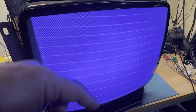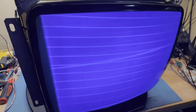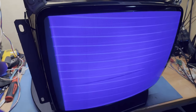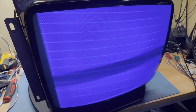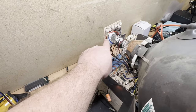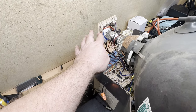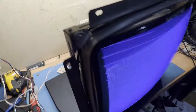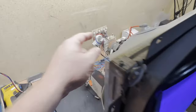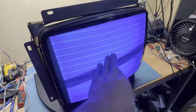What you see here is an all blue screen with raster lines. The flyback is turned completely down — 100% all the way turned down. All of the color pots are dead center, so it's not an issue of the blue being turned up too high, and even if it was we wouldn't have raster lines. If you leave this on for a couple of minutes, this resistor starts to get white hot and starts smoking. It's fairly warm and getting warmer. So there's something wrong with our G2 circuit — the G2 voltage feeding the neckboard is way too high, which is what's giving us these raster lines.